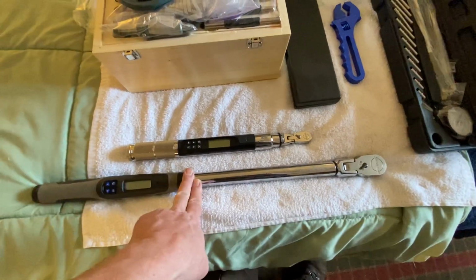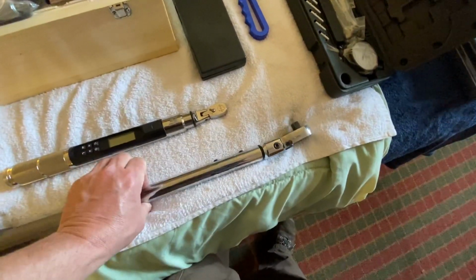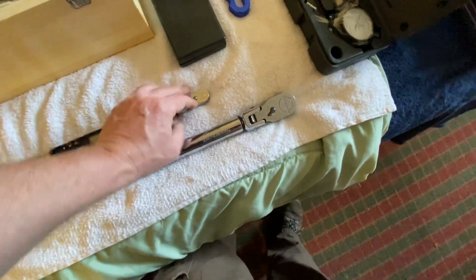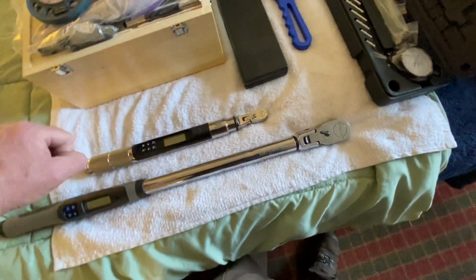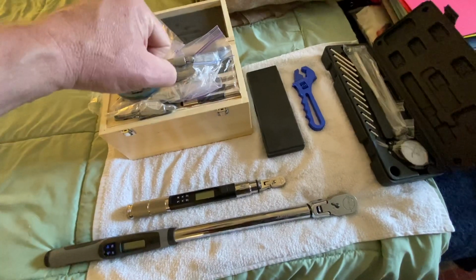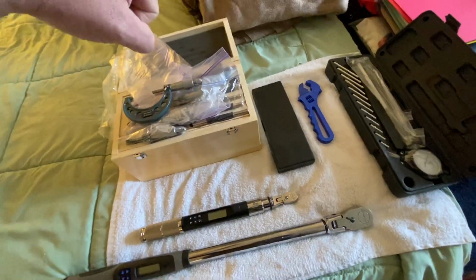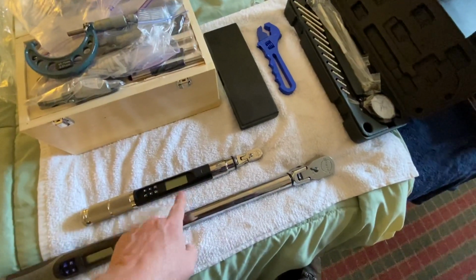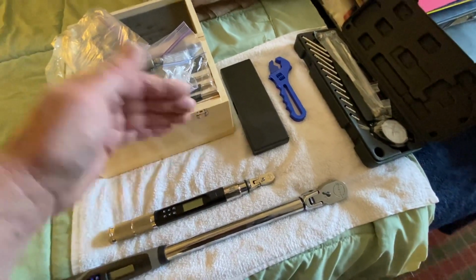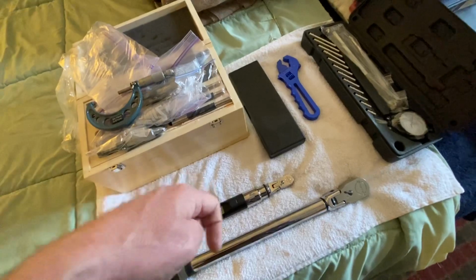The other thing I used when I removed a cylinder head, or to remove a bolt or a nut at this 1/2-inch drive level or at this 1/4-inch drive level, both of them work the same way. You can flip this to off, so it's backward. Instead of tightening, you're loosening, and you can turn it on, and as you put torque to it and you are freeing the fastener, it changes the number, however much torque is on, and then it shows peak torque. So once the bolt breaks free, it keeps showing you the torque as you move, and once you stop, it'll reflect the highest torque number. So like all these nuts I've been loosening, I used it once with a torque wrench and saw how loose they really are versus what the torque specs call for in the manual.